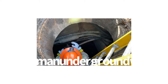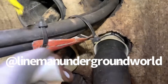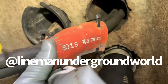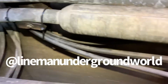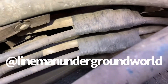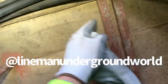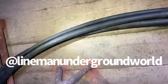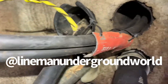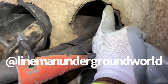What we're going to do now is cut in the clear and cap it — we'll be good for another 100 years. Standby. So this is our cable here — it's got a beautiful tag on there. It goes around, comes back down, and taps into the lead here. It's got stingers on this side. What we're going to do is get some double doubles put here and here, and we'll be able to rack it in and have places to tap on later on.